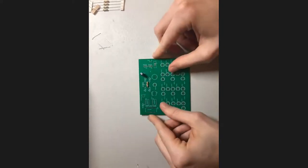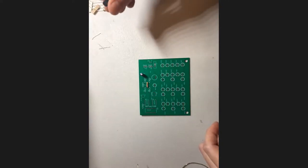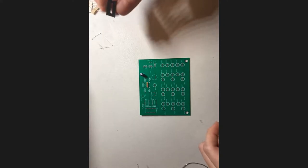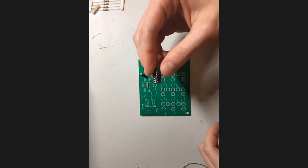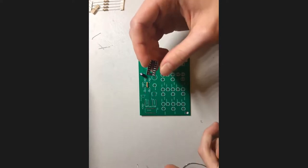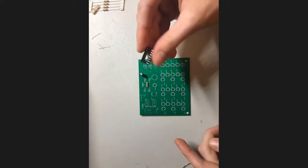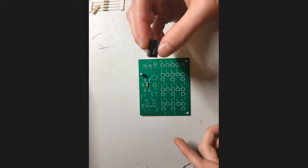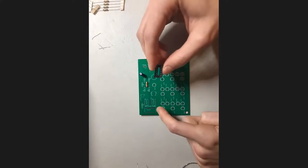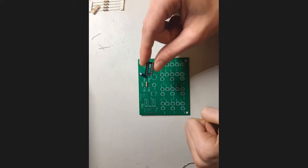We mentioned in the Kahoot, although we hadn't really mentioned before, that you don't want to solder your ICs directly onto your board. This is because ICs are by far the most delicate part that you're going to be dealing with. So what you're going to want to do instead is solder these things called headers directly into your board. They're kind of like sockets for ICs. Then at the end, after you've soldered everything on your board, you're going to plug the ICs into these headers, and theoretically, your circuit should be able to work after that. Do note that both these headers, your ICs, and actually the outlines on the board all have divots or half circles on the top. So you do need to be very careful with the directionality of all these chips.